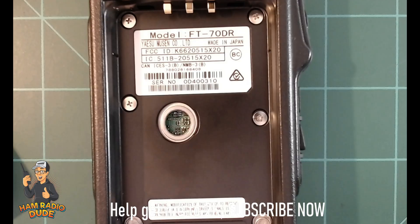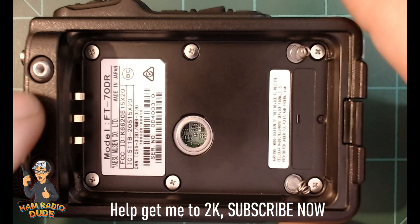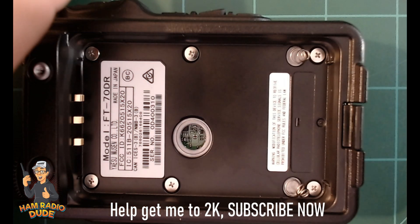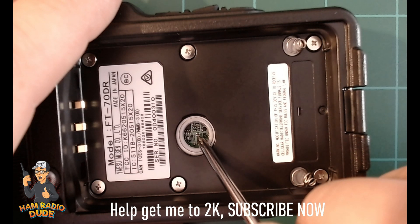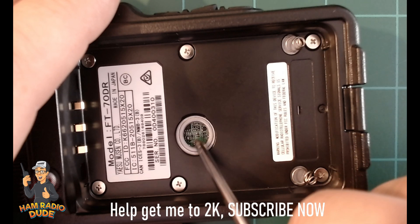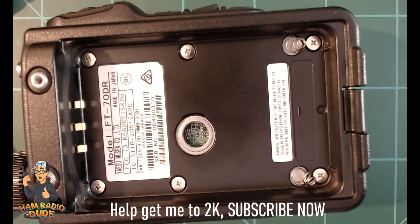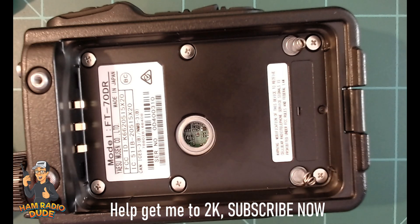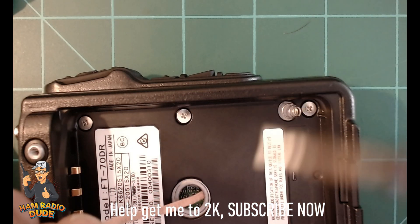So this is where I zoomed into the actual radio itself. I'm orienting the radio with the top facing to the left and the bottom facing to the right — it's just easier for me to get in that way. What I'm demonstrating now is the resistor that we're looking to remove. The best way I found to remove it was using the solder braid to get some of the solder off from that resistor point.